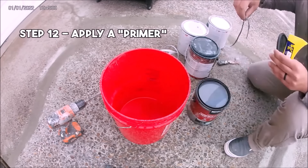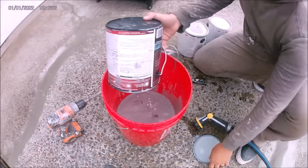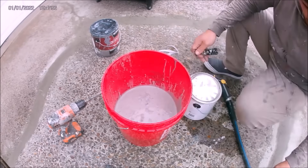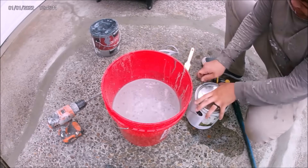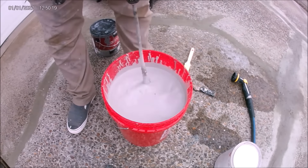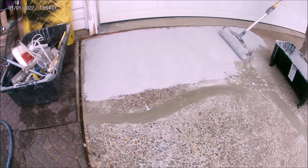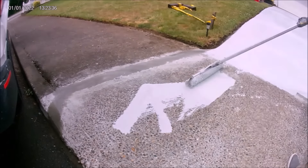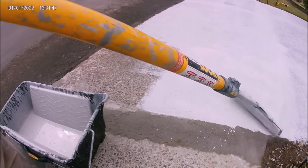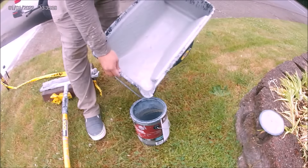Step 12 is to mix and apply a primer coat. For the first coat of epoxy I actually water it down a little bit. The reason I do this is that apart from acting like a primer to save on material for consecutive layers, it also penetrates a little bit deeper into the pores of the clean concrete and tints it, so that even when peeling inevitably happens in some areas, the concrete beneath the epoxy still has a somewhat similar hue. This step could be skipped, but it does make the following layers of epoxy easier to apply and tints the concrete better so that future peeled areas are less of an eyesore.